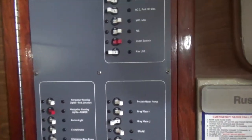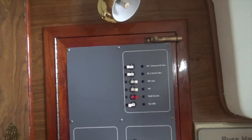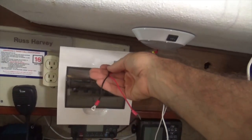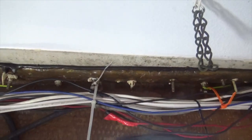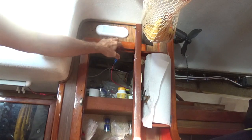This is the new panel — if you come aboard you can touch it if you want. I'm eventually going to put an ammeter here, and maybe a voltmeter, but I don't buy stuff willy-nilly. The only remaining work on the electrical system is to run power to a couple of lights, because the existing wire — it looked like it was from World War II — individual reds and blacks and blues, and wherever you see electrical tape that was the scene of an old splice of some sort, that's a sign you probably need to upgrade and overhaul. It'll work, it's not pretty — in fact it's atrocious-looking as far as classic boats go.